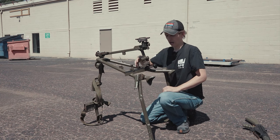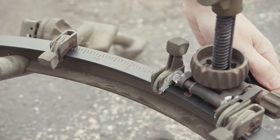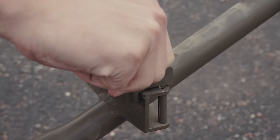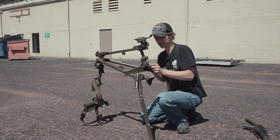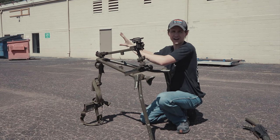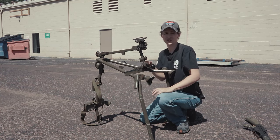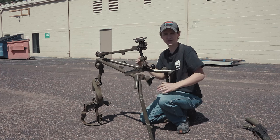and have exact adjustments. On this whole mechanism here, we also have this throw lever, which can be pushed up, and then you can move the gun left and right in case you want to set search fire or simply adjust it to a certain position. In addition to, if you were to move these other throw levers in and lock them down and pull this button out, what we can do then is we can do a very precise adjust fire position and have a very set specific square you're firing into, and you can fire throughout that square within exact adjustments, which is a pretty cool little piece of technology here. It makes it very nice. You can either set a very specific firing position, or you can kind of set up a grid that you want to be able to fire into and just do some sort of search fire pattern.